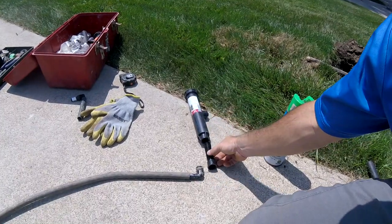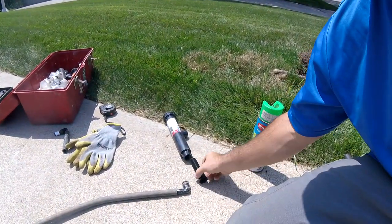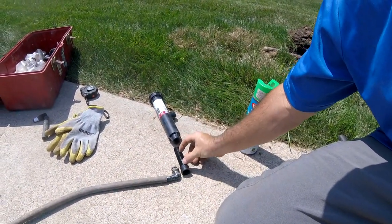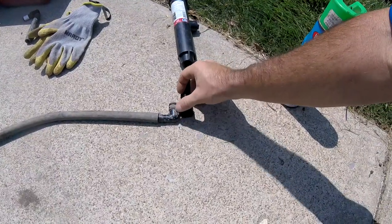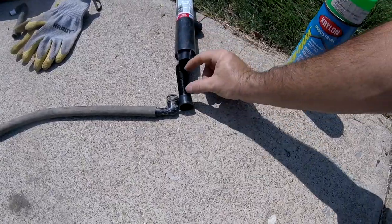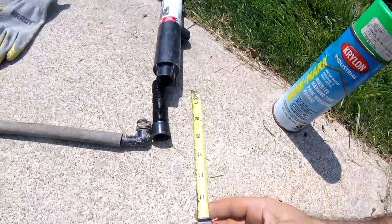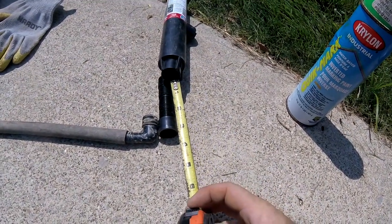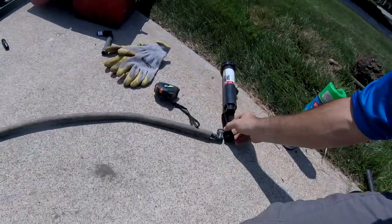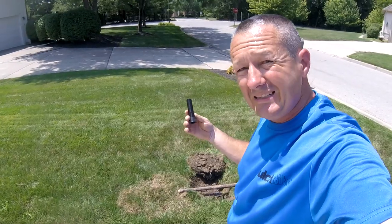In this situation we only need about two and a half inches. Measuring from top to bottom — this screws in that far at the bottom, and the head screws in this far at the top — that leaves this section in the middle actually raising the head, which gives us just over two inches. So one of these riser tubes by itself is going to be perfect.